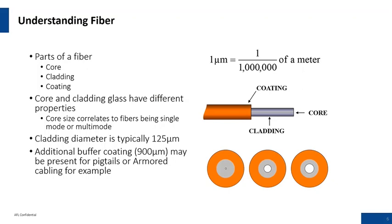Some fiber background information. Understanding fiber: the parts of a fiber — you have the core, which is glass; cladding, which is also glass; and then the coating, which is typically a UV acrylic material. What is one micron? This is something in the industry that's hard to get people to realize how small one micron is. I like to use the analogy of a particle floating in air and a light ray hitting that particle. If you can see that, that diameter of that particle is probably around 20 microns — what we're trying to align with a single mode fiber is typically a nine micron core, and that 20 micron particle floating in air certainly could create havoc. In a field environment you're dealing with millions of particles.